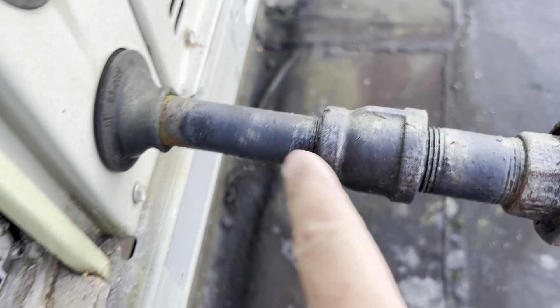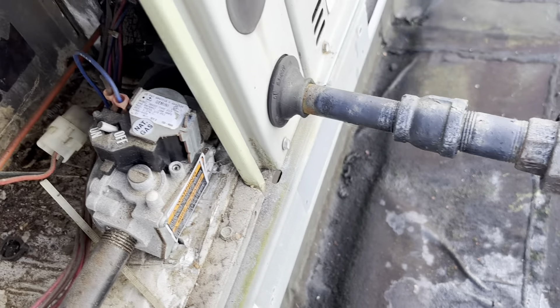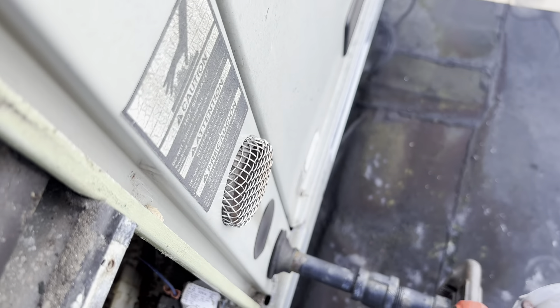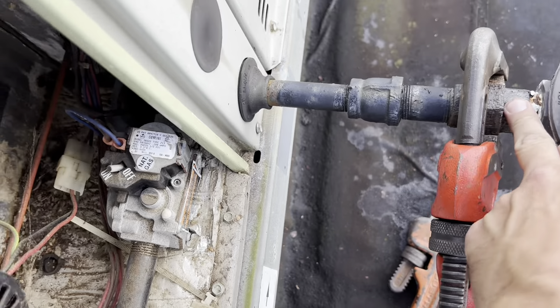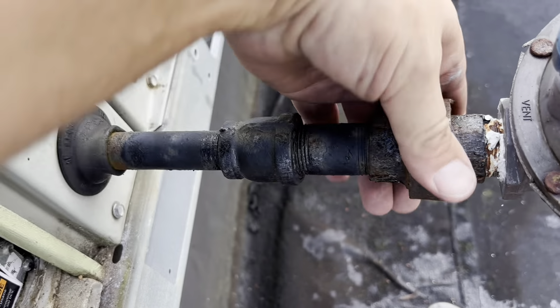The nipple goes from here into the street L — that's not as bad as I thought. We're going to break this union, take this pipe off the street L. I don't know if there's enough room to swing that, so if not we'll take the manifold off and get that valve out. Let's see if we can break her free with just one wrench — wow, that is tight. I'm spinning the whole thing. We needed two wrenches on her — got her. We'll test the union once we get it all back together. Always be careful when tightening anything on these regulators — I've split one before, it's very easy if you put too much tension on them.